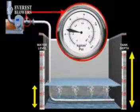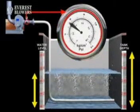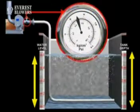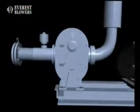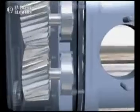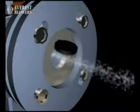The blowers, being positive displacement type, do not develop pressure within the casing, but the discharge pressure depends upon the system resistance or back pressure. Effective sealing of the blower inlet area from the discharge area is accomplished by use of very small operating clearances, eliminating the need of any internal lubrication of the lobes. A pair of accurately machined alloy steel, hardened and ground timing gears maintain clearances between the impellers during rotation. The air thus delivered is 100% oil-free.